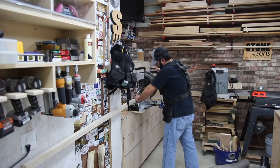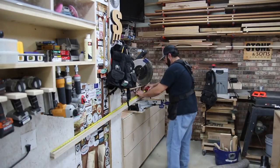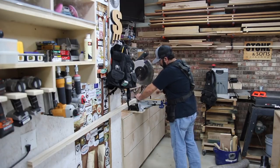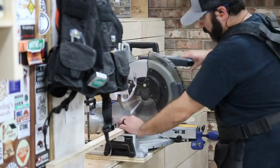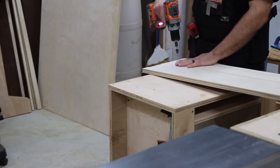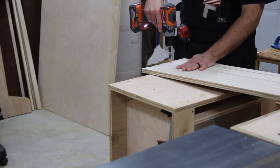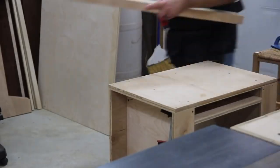With this particular style I'm making the four outside pieces — the two ends and the two sides. But there are also going to be some internal parts. I'm cutting down on the table saw a bunch of strips of plywood and cutting them to length. This is going to create an internal section of the bed underneath for support — kind of where the slats would go, but they'll all be installed beforehand, with a panel on top. I did make a mistake here and drilled too many holes in too many pieces — these pieces are for the rectangular support, but I went ahead and drilled holes in everything, which I didn't mean to do.